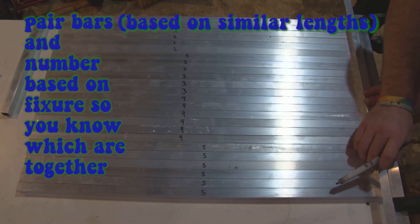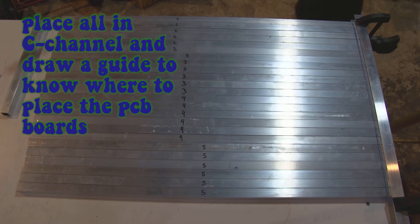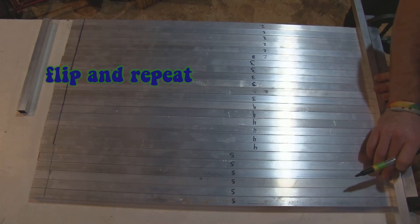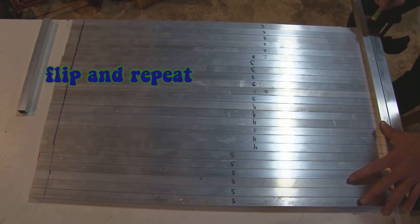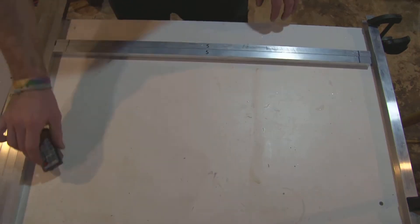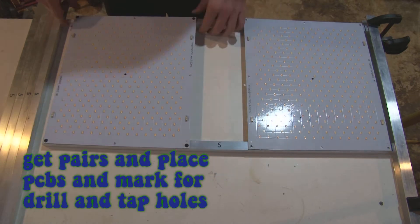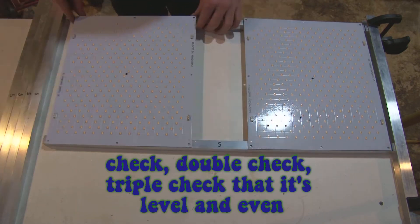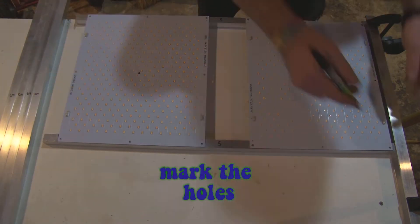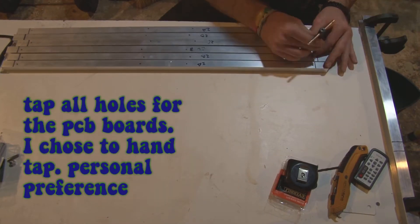Each fixture should have all pieces very similar — maybe a millimeter off instead of quarters of an inch off. The reason for this next part is to get an inset from the C-channel and the PCB. I want to know where I'll be laying the PCBs — the absolute outside of the area I could place them — so I don't later find I can't get the PCBs on because I mismeasured. My goal was to make sure the PCBs were absolutely even, the bars were absolutely even, and the PCBs were inset just slightly from the bars so there's no overhang. Then I mark the holes and put a letter to pair which two bars go together for each individual module.